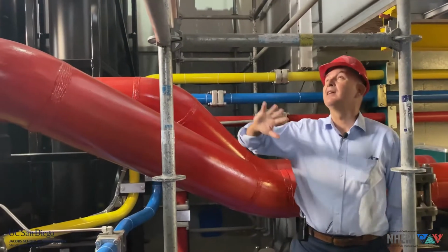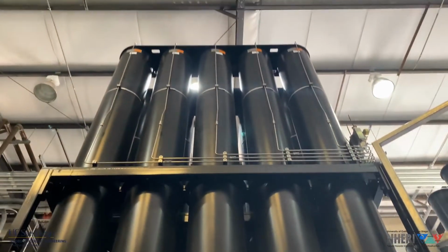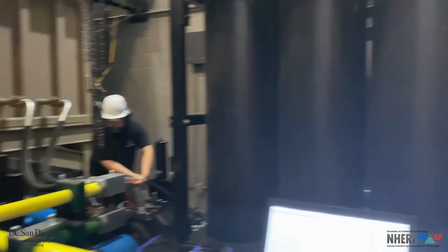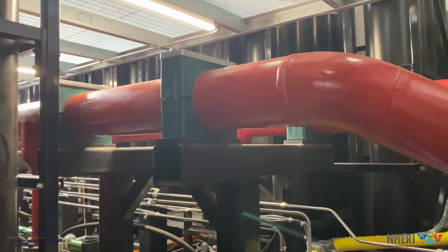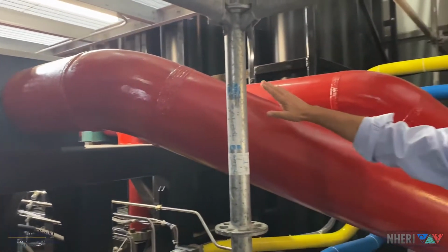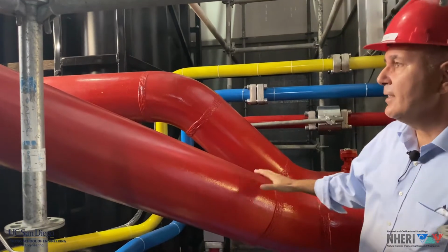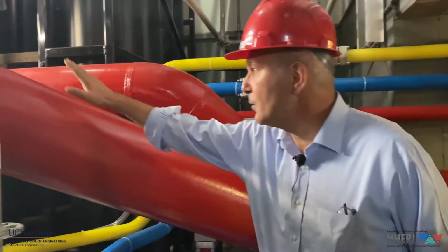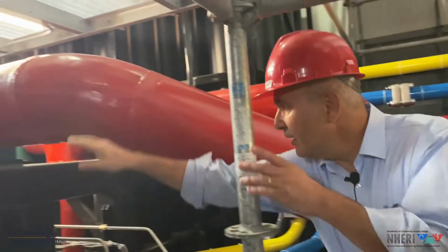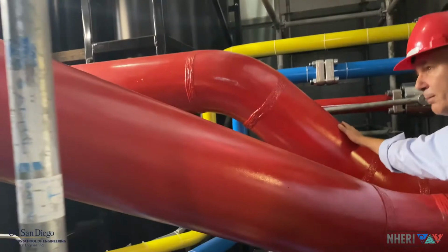So now here you see the incredible height of this new accumulator bank, and again the surge tank from below. And you see the 2 pressure pipes. Most of these pressure pipes were prefabricated by GS Hydro in Houston. One link that had to be welded on site is the one that I'm showing you here. So you see these 1, 2, 3, and 4 big circular welds. The same thing for the second pipe in the back.